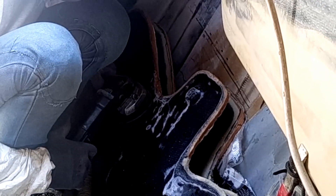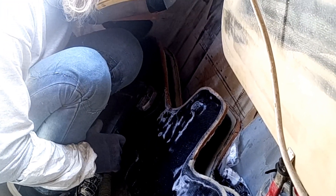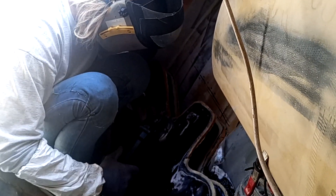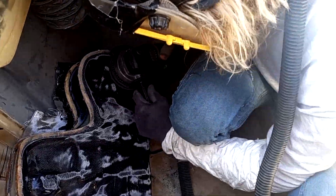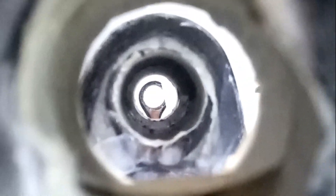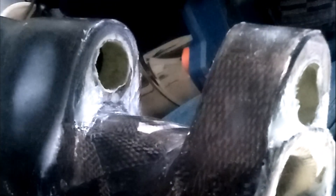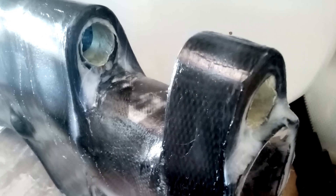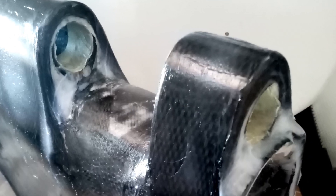With a grinder, I'm taking off the high bits of the glass fiber that I stuck over this carbon, and at some places I take a bit of the carbon away as well. It doesn't have to be perfect, but it needs to be smooth enough so that we can handle it. Because as we lined out all the pipes on this rudder housing, we now need to line out the top hinge on the boat as well. For that, it needs to be hanging behind the boat, and it will always get wet and dirty, so we need to make it reasonably smooth and paint it with a bit of epoxy.